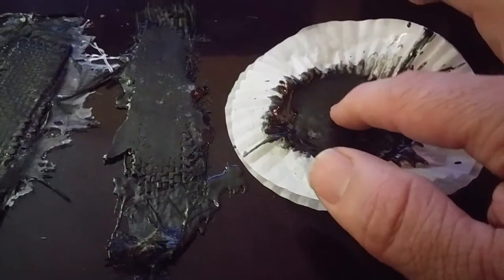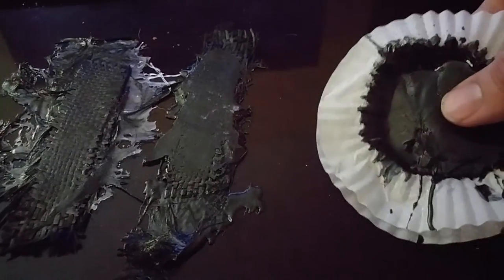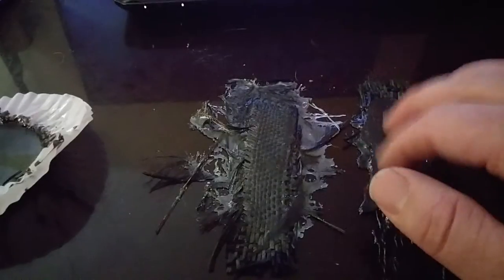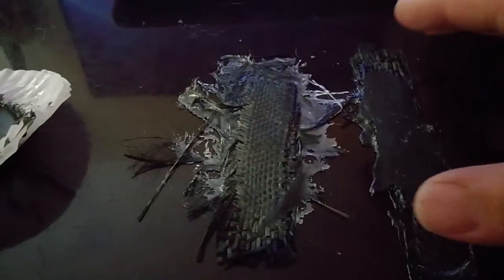What's left over is the resin casted — it's like a hard plastic almost, like ABS, but a little more flexible and more gummy. These are fully cured at four hours, and this solid mass might take a little longer to cure — that's just how it works. You might put it in an oven and heat it up to cause it to cure. When you put the resin together it heats up — it's a thermoset plastic basically.